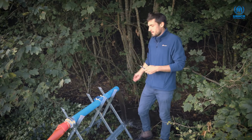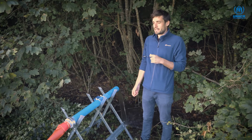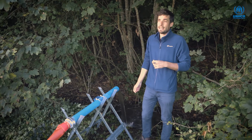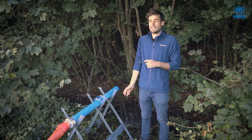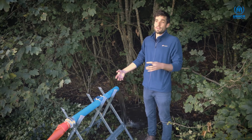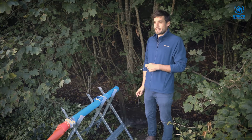At the moment it's coming out at about one litre per second during our step test. Another important thing to note when discharging pumping test water to the environment is to comply with all local discharge and water quality regulations — you don't want to be discharging potentially silty or unknown-quality water into a public stream or a ditch near somebody's house.